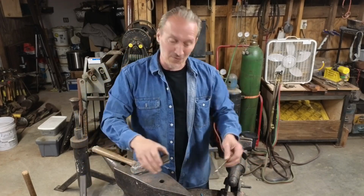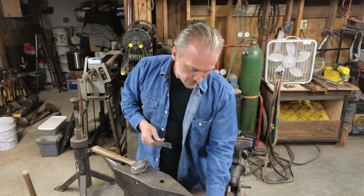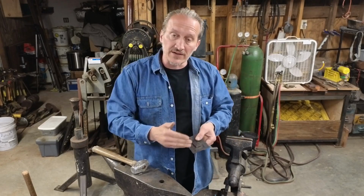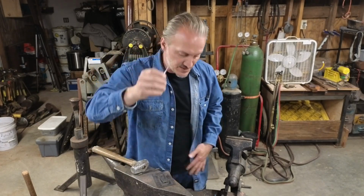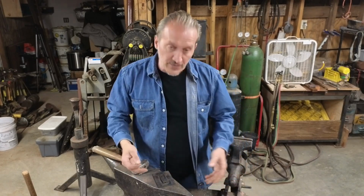So you've got everything right where you want it. So the hinges are fun. That's one of those. Cutting hinges can be extremely tedious. You've got to sit there, fold the metal in half, pinch the knuckle in, set your hinge pin, and get it set in there nice and tight. This is just a piece of 1/8" material here. But it can be time consuming, and then you've got to file in your profile or grind in your profile.